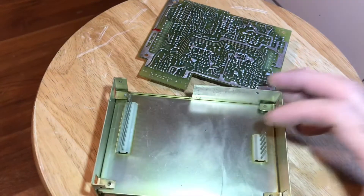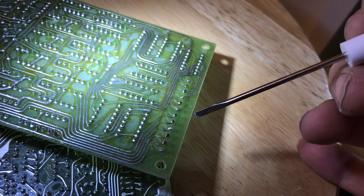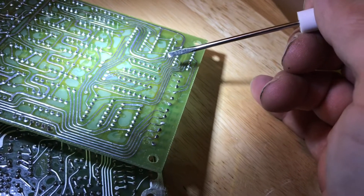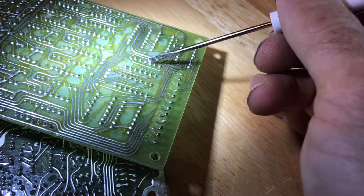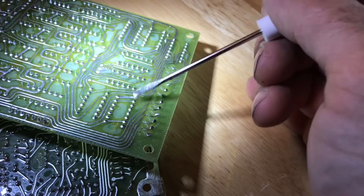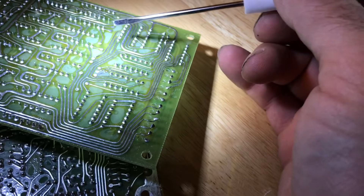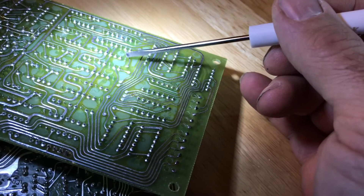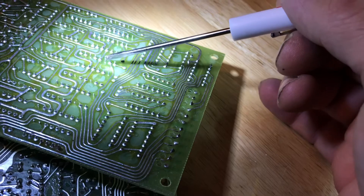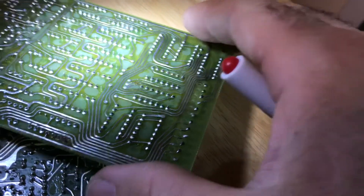The pins look like they remain in the center of the sandwich of boards here. Looking at the back of the boards, I didn't see many issues. There are a few solder joints that have some almost mold flux or something around them — just kind of odd because the vast majority of the others don't. So I'm going to reflow those and clean them up. You can also see there are some pins that don't have any solder — those are pins that actually don't go to anything, unused pins on these ICs on the other side.